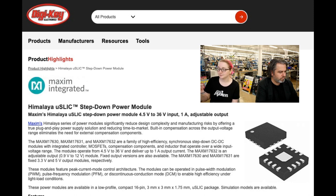One of the things you also notice fast with buck converters is that you have chips, and sometimes you need an external MOSFET, an external inductor, and external capacitors. Before you know it, it gets kind of large, and as the board gets larger and components get separated, efficiency can go down because of trace resistance and less integration. What's interesting about these modules is they're so tiny and all-in-one — they even have the inductor built in.